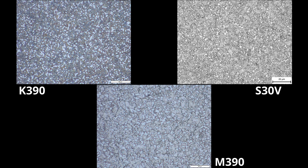They all have between 15 and 18 percent vanadium carbide, and they are relatively fine. These microstructures are finer than many stainless steels like M390, for example. They have less carbide and finer carbides than those steels because it's only vanadium carbides. Vanadium carbides tend to coarsen more slowly than chromium carbides, so when you have a non-stainless steel made up of only vanadium carbides, the carbides are smaller, and that can often lead to better toughness. The microstructure of these steels actually looks quite good when compared to steels like S30V or M390.